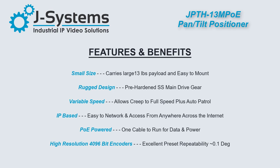It comes standard with variable speed made possible by a built-in microcontrolled closed-loop DC servo system. It's powered from 802.3AF PoE power, so only one cable is needed for power and IP data. The built-in web interface makes control user-friendly and very intuitive. It uses 4096-bit encoders, offering repeatability in the 0.1 degree region. The aluminum powder-coated outer components with stainless steel hardware make this a very tough but high-tech pan tilt positioner.